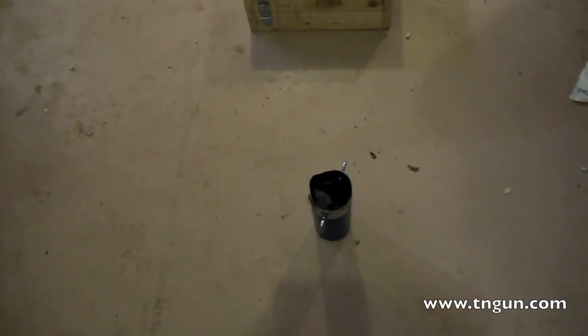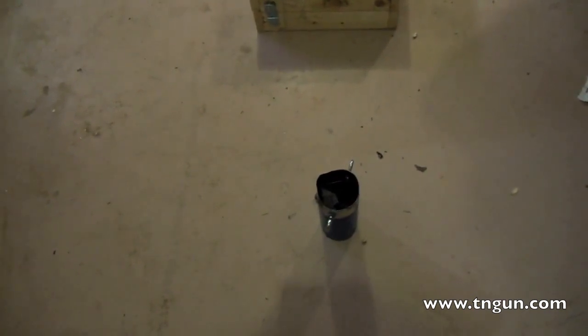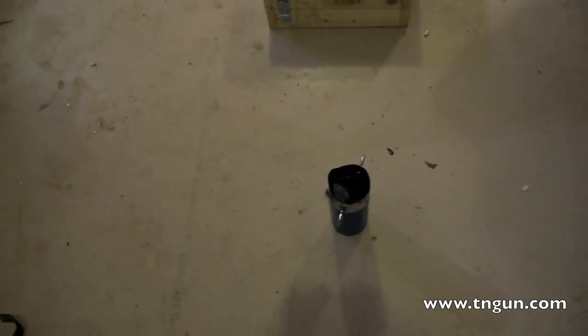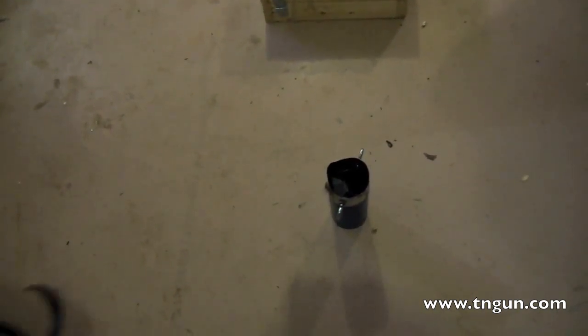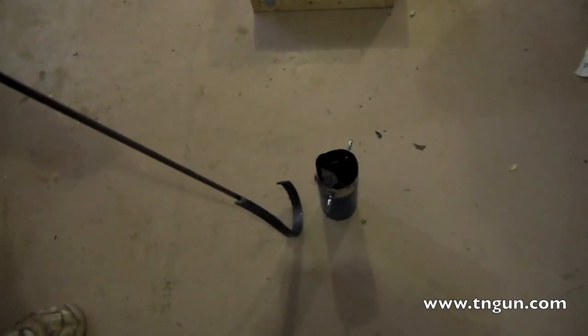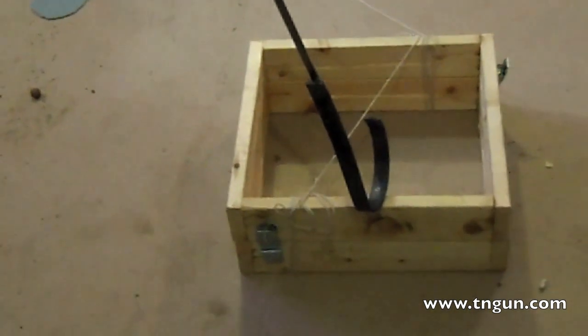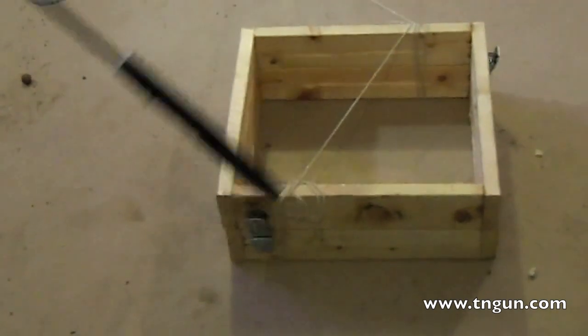You've seen pictures of our crucible tools, and now we're going to show you how this stuff's going to work. We still have to practice with all this — everything I saw in FoundryWorks says you need to set it up where you're working in a circle. We're going to simulate that this is where the actual furnace is with the crucible inside, and next to it here is our cope and drag, which is our mold, with pattern and sand in there.